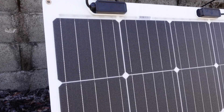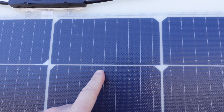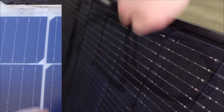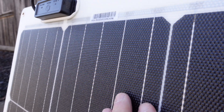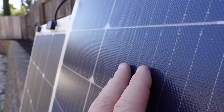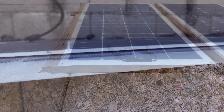This is a newer design from their 175 watt panel that's been very popular. The new one now uses half-cut cells and nine bus bars, which is pretty much the same technology that you'll see in residential panels installed on homes and businesses. The older 175 watt panel had plastic beads that helped absorb light — the new panel does have the same plastic beads but not as prominent. The new panel comes in at three times the thickness, which makes it a little more rigid and more durable.